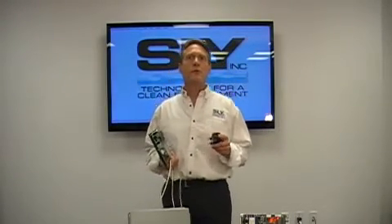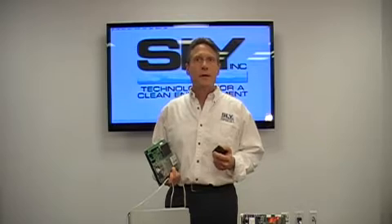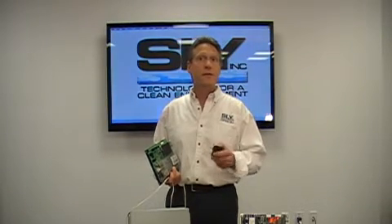The basic function of a pressure module is to limit the compressed air pulse cleaning to only when sufficient dust is accumulating on the filter bags. Called on-demand cleaning, the pressure module saves you money by limiting your compressed air usage, extending the life of your filter bags, your diaphragms, and your solenoid valves. The module also improves your bag house's efficiency by maintaining a consistent dust cake on the filter bags or cartridges.